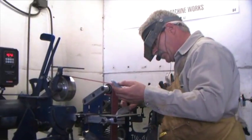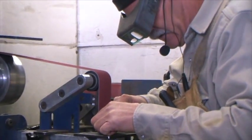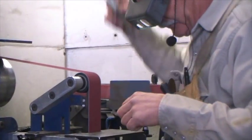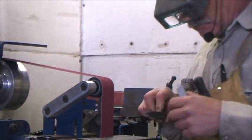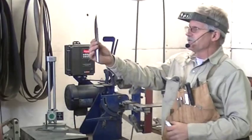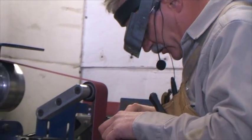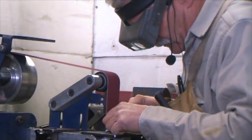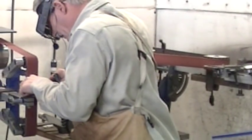So I'm going to come back over here and do that, using the stick again and keeping my pressure up high. And this time I'm going to use my arm, this arm, and then pull out and then go along. And as I do that, you can see that it starts to blend all that together. You want to be careful — if you're looking for a full-length grind across there, you don't want to go too much on the cutting edge. You're trying to get this whole thing flattened out and blended.